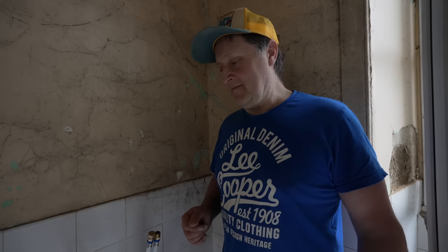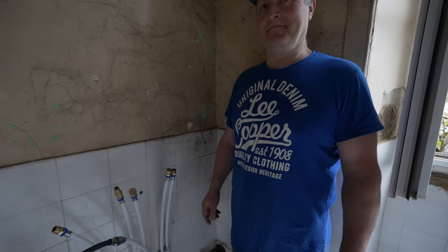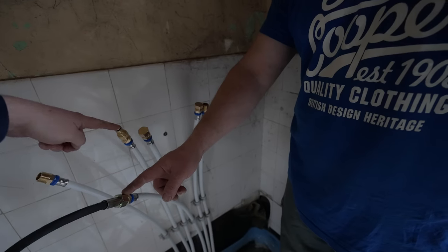I'm 100% certain it's never going to leak. These pipes - the audience will know what they are - they're PEX, multi-layered with aluminium between. Generally they're the best sort of pipes to use because they don't leak. They've been on the market for about 30 years - you can cut the first layer of plastic and they still won't leak. I keep getting this phone call from Mountain View, California - I don't know who that is. Anyway, we're going to release the pressure on this one and fill that circuit up with water, then pressure test the last zone.